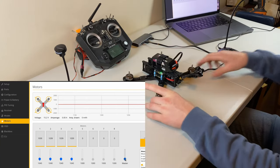Now the drone is fully set up except for the OSD. If I connected props right now, I could hit my arm switch and give it a little throttle and that drone would lift off. I'm going to go into the OSD now — the OSD just shows you anything you want it to. I'm going to hook up my goggles. No OSD is the same, so you're going to want to have your goggles open so you can see exactly where on the screen you're moving stuff. I'll hit auto search to find my right channel — looks like I'm on A8. I'm going to select my RSSI — that's signal strength, you always want to have this — and put it on the left of my screen. I like to keep the warnings at the very bottom of my screen. I'll add my craft name too — if you have more than one drone, this is a really easy reminder.